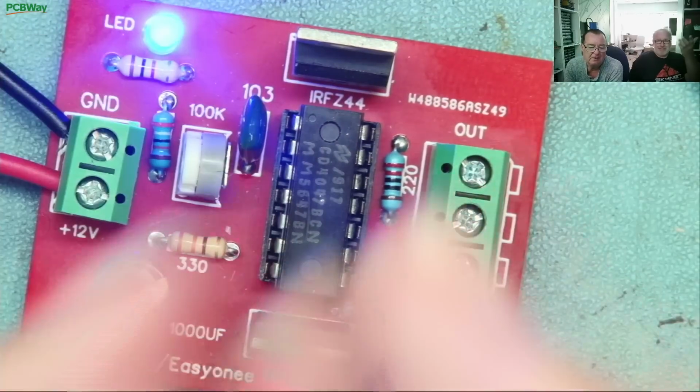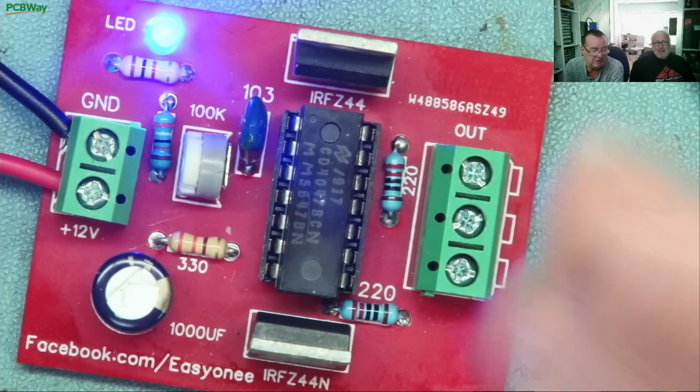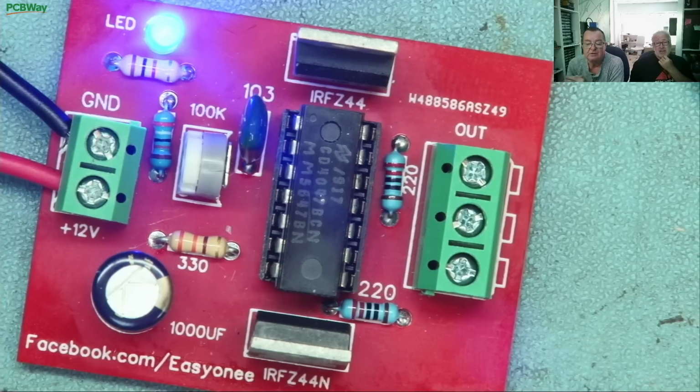I think it's just a defective batch of chips. Either way, defective or rejects, where you go, okay, we have the basic function, and if nobody needs the inverted digital outs, that will do. But for our case, it didn't. So, guys, the 4047: if you need one for a project, be careful where you buy it from.